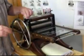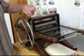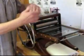The other feature that the Galleon has is synchronized pressure screws, so that you don't have to get hold of both of them, you don't have to count them — they're going to stay synchronized and the roller is going to stay flat.